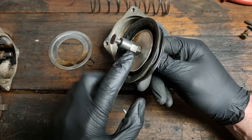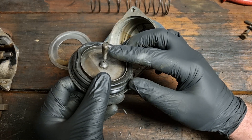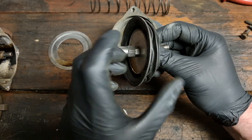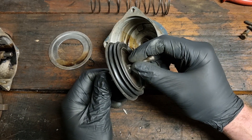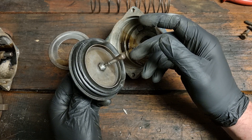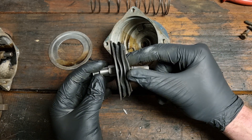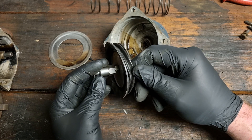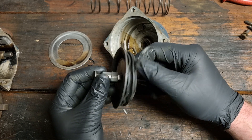Now we've got our guide, we've got our damping valve down here, and here's our diaphragm. A rubber part can perish and can put the governor out of whack. They've had a great life but if you're rebuilding one I suggest you replace this straight up.